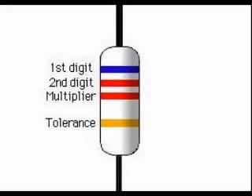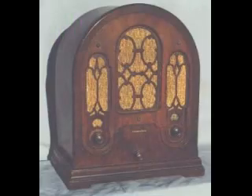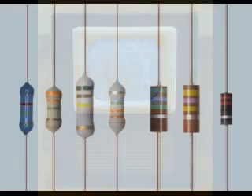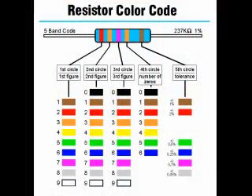To review: four-band resistors consist of two color bands representing the first two digits of the number, followed by a multiplier, and then the tolerance band. Not all resistors have a 10% or 5% tolerance band. Many years ago, some resistors had a 20% tolerance, which was indicated by not having a fourth color band — you might find a three-band resistor in an antique radio or television. For most applications, 5% or 10% is more than adequate, but some requirements demand a more precise resistor.